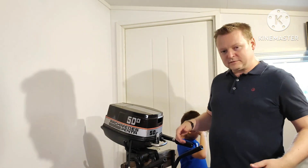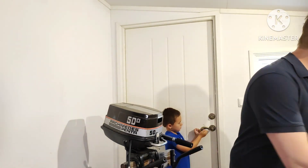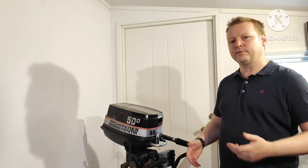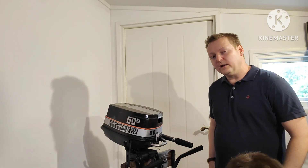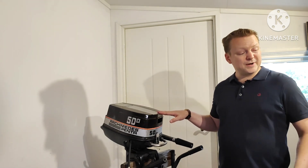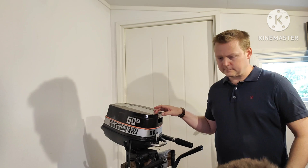Then we have the battery pack. With the gasoline motor I usually carry a big red canister of the stinky, oily gasoline — it's just nasty. For batteries, one option would be to buy crash Tesla battery modules on eBay for around $1,500 to $2,000 USD, and you'd get about 5.25 kilowatts, which is a pretty sweet deal given lithium battery costs — but you'd only get a 24 volt system. I'm actually planning on doing this at 72 volts nominal, with a range of about 62 to 81 volts.